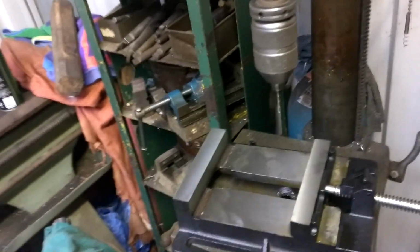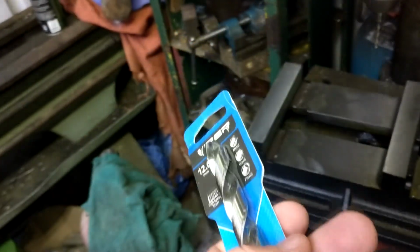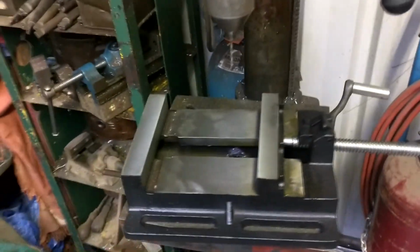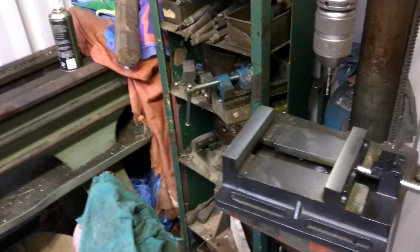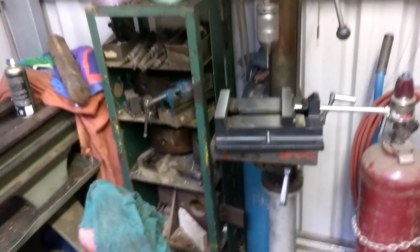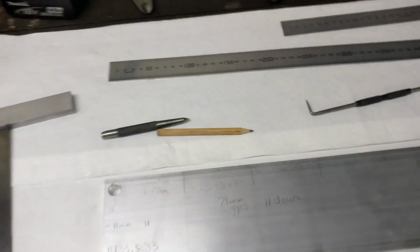With me landing on this bit of weight, it won't move around much. I'll take it easy. I've got good lubricant. I've got this nice shiny new drill. In fact, I'm going to use nothing but new drills for this. They need to be really sharp, really perfect, so that the holes don't wander at all. Nice finish to it. It doesn't grab at the aluminium, and then that will be less problems and a much better result, which I will be much happier with than a poor result. Alright, back to it. I'm going to mark these out and start drilling.